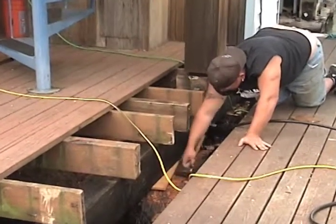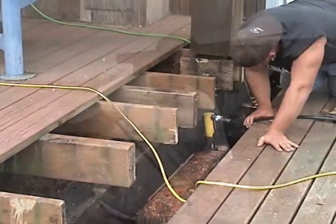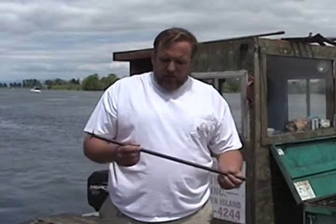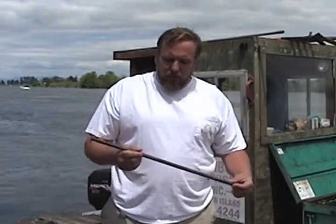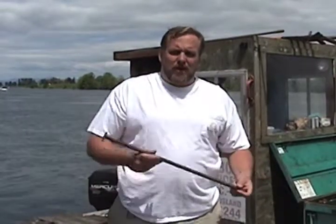After that process, the house is put back in, then we come back and shim up the stringers with weather-resistant material and pin them with large pins — this sometimes has to go through the floor. In a lot of cases we're able to make small openings into the floor, but if it's inside the living room or the kitchen, the floor covering is sometimes compromised so we can get these pins through. After the house has been reshimmed and pinned, it's just a matter of putting everything back together.